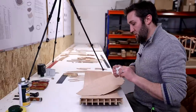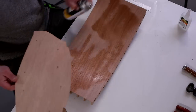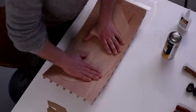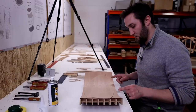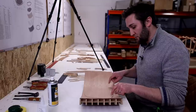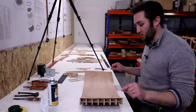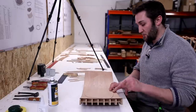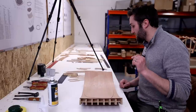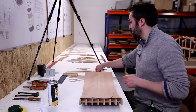Now we really want to hold that in place. The best way is probably some double-sided tape or a couple of little dots of mitre fix, which is what I've got here. That doesn't want to be permanently stuck — it wants to be removable. With 18mm jig components you'd be able to put a couple of little screws in and just pin it in place. It just wants to be temporarily pinned, and then that forms the positioning element for all of our components that go within it.